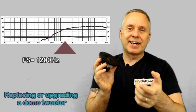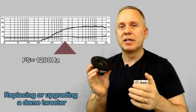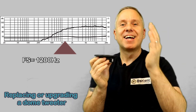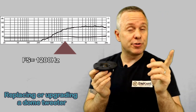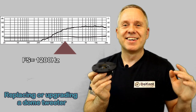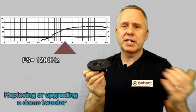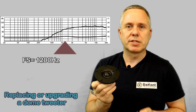You need to look at your crossover frequency. If it's a second-order filter — 12 dB per octave — you can roughly double the resonance frequency of the tweeter to find the minimum frequency you should be cutting at. If it's a first-order filter at 6 dB per octave, meaning it's only protected by one capacitor, then it needs to be four times the resonance frequency. Try to match the resonance frequency to the old one, or go even lower — that will generally make your tweeter section sound more calm.